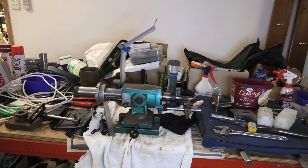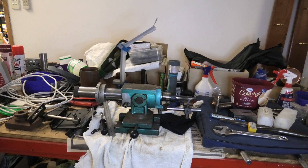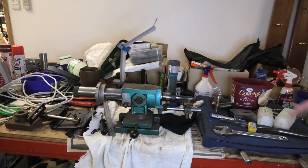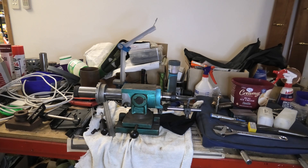Here's a piece of my kit you probably haven't seen before - it's an air-fed spindle. Quite a good old unit. I bought it off a bloke who was sharpening cutters for money. We used it for probably a year for annular cutters, but we had a lot of lost time - you had to get in the back and loosen a nut to change the angle of the shaft, and it was just a pain. So I bought a small work head and that eased the job substantially. This is originally designed for flute grinding. It's got a 5C collet set up, and I don't have a lot of 5C collets, so I've got a 5C to ER32 adapter - I find the ER32 is in my opinion a much better chuck. But I'm having trouble indexing it with the finger - it catches a lot, and if you can't guarantee a smooth action as the shaft goes backwards and forwards, you don't start grinding. It'll be a disaster.